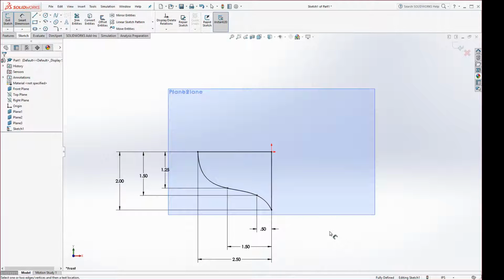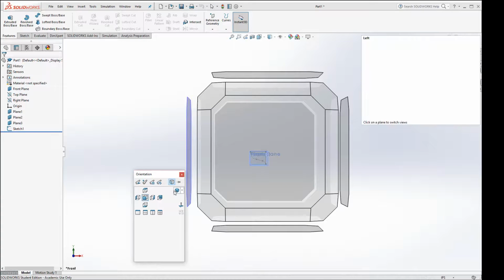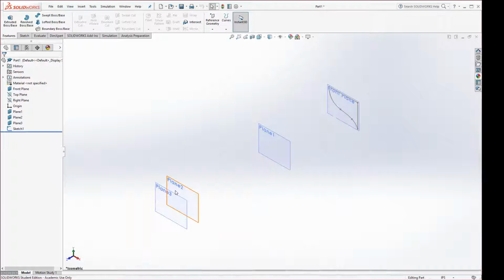And if they're all discombobulated or just tied into a knot, you'll actually tie your spline into a knot as you do this. So again, very good, clean sketching techniques are required here. All right, at this point, go ahead and hit Exit Sketch or Rebuild. Now, if we hit our space bar and go to the isometric right here, you'll see there's the back of our boat. Now, we want to copy that sketch onto these additional planes.